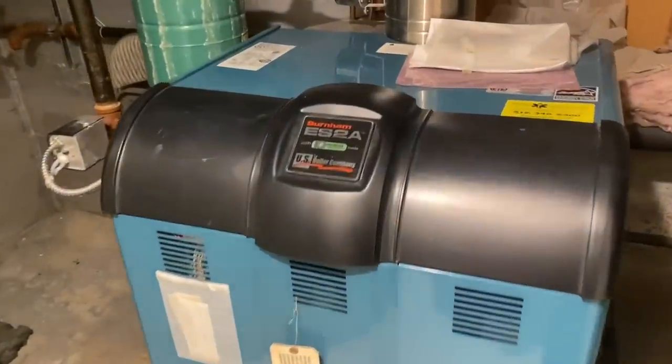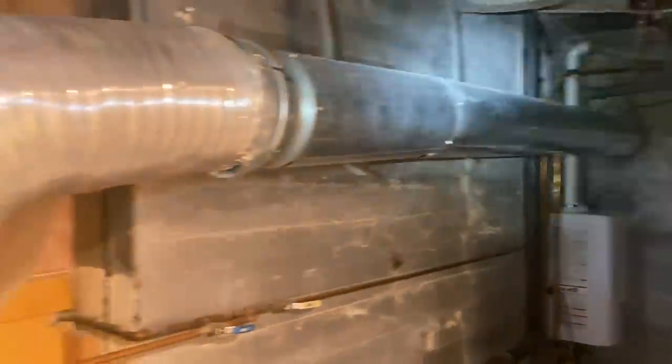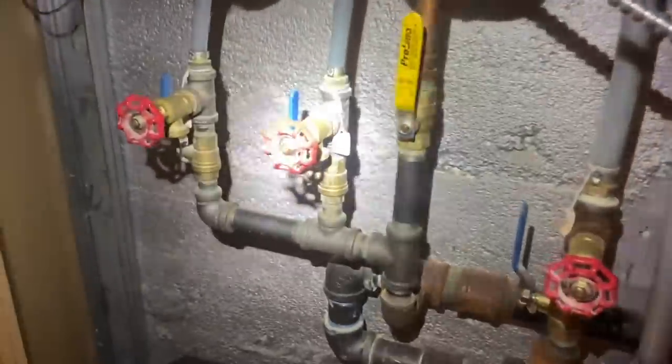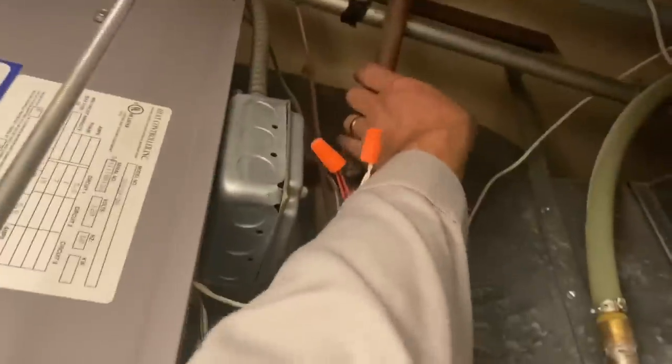Look at the head - it's a big boiler. Let's find the dining room zone. Base supply, second supply, first supply, sun room... We can go to the air handler which is right across the hall. Let's see if we have hot water circulating the fan coil - yes, it's good. It's a comfort air handler with evaporator and integrated hydronic coil.